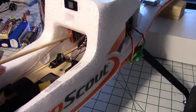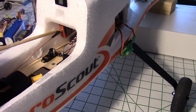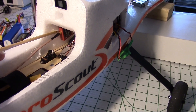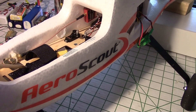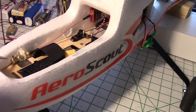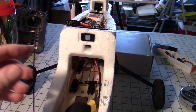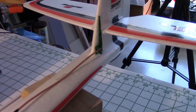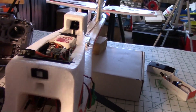The 433 MHz receiver — Easy UHF — is mounted right here. You could use a Dragon Link, Open LRS, or Team Black Sheep long-range. Whatever your receiver is, I've got it up underneath here with the cable running right to here. The connector is a 90-degree connector tie-wrapped to the plywood, then runs through the wall right here. That gets me about 26 inches away from the video transmitter antenna in the back, which gives enough separation. The GPS is pretty far away from it too, so that's going to work out well.